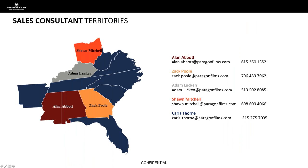I just want to thank you guys for joining me today. To recap — blown film uses a circular die, inflating a bubble, with lots of inconsistencies, noisy unwind, difficult handling, and residues left behind. The cast process — which Paragon has committed to intentionally — gives you high quality, highly consistent, high-performance hand films with excellent clarity and exceptional puncture and tear resistance. And to recap Edge: 80 and 90 gauge, 18-inch true width, 1,500-foot true length on the rolls. This was designed for you to go head to head with those other conventional hand films out in the field.